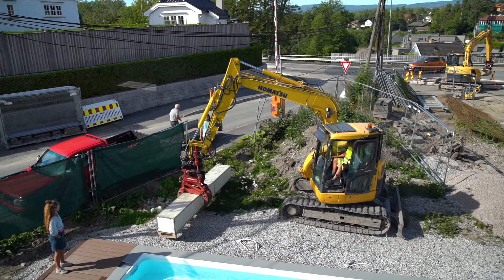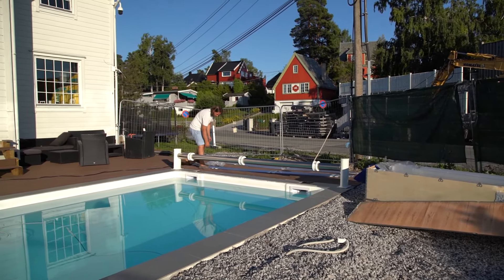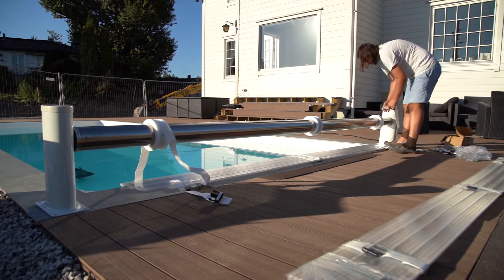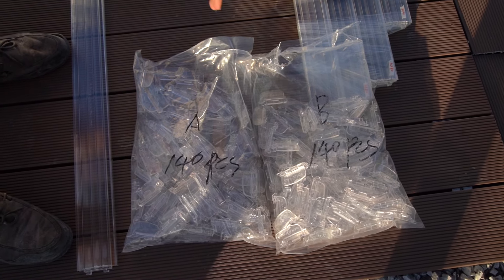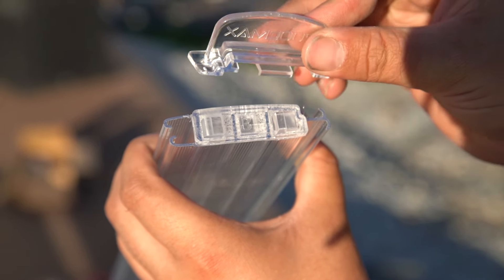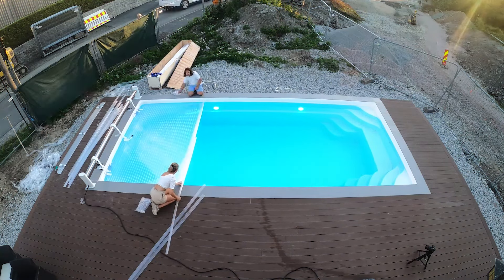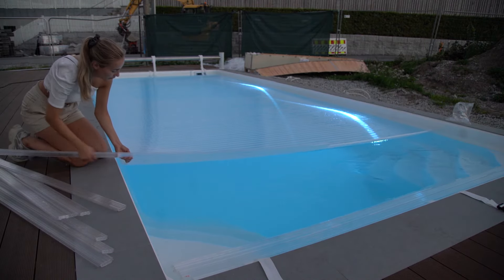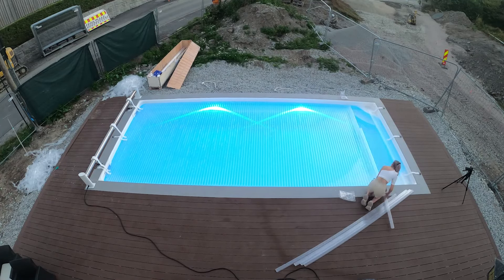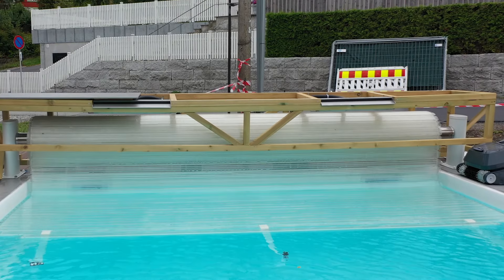For pool coverage, we bought polycarbonate slats directly from a Chinese factory. The automated covering system with rigid slats ensures safety for objects up to 100 kilos per square meter — yes, that means I can safely walk on the cover. The benefits of polycarbonate over PVC slats: more resistant to high temperatures, higher impact strength, no discoloration, and a longer service life. When installing the slats, one end is marked A and another B, each with their own clips — the same letter must be on the same side. Connect slats by sliding them together and use the clips to lock into place, repeating until all slats are connected. When ordering, you must provide exact measurements including length, width at multiple locations, and angles to ensure slats fill the entire pool.